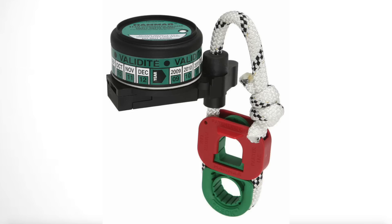After that you are going to have a life raft at the end of a line, so don't let go. The second way a life raft can be activated is automatically, using a HRU — a hydrostatic release unit. You install it on the life raft; it's used in the event that the vessel is sinking. Once the HRU gets beneath 4 metres of water, that water pressure activates the unit, which cuts the line and sends the buoyant life raft to the surface whilst inflating it.